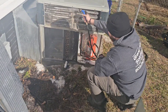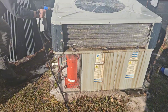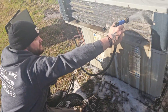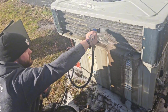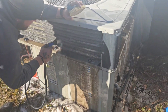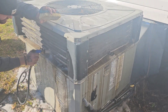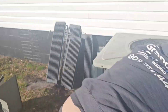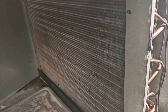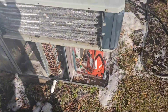So glad I got that coil gun, even though Chad advised against it. Water just does fine — water does fine. I'm not gonna lie, it's kind of therapeutic to see all the bubbles and everything just pulling the dirt out. That evaporator coil looks a little better — should strip a little bit of that grime away.